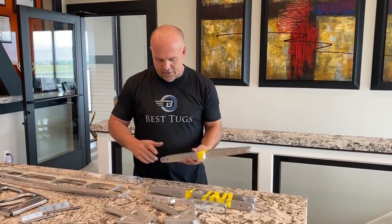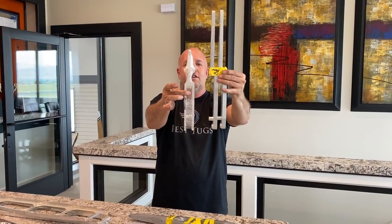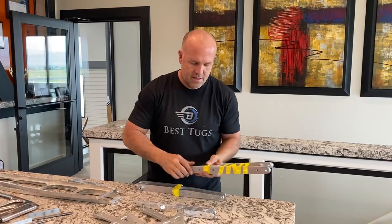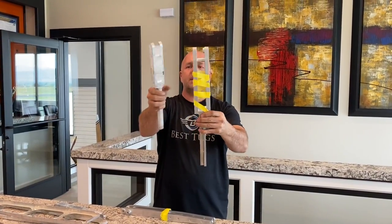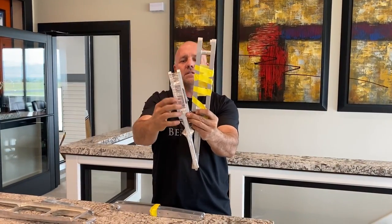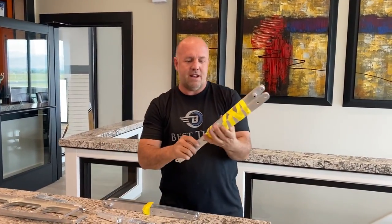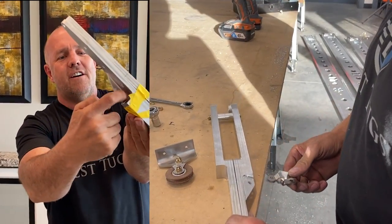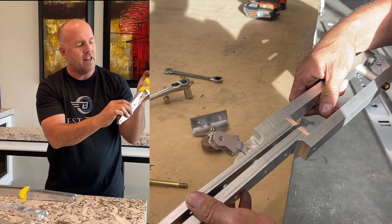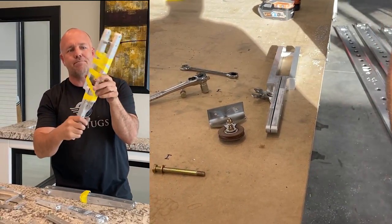So this gives you a comparison. I went ahead and did a similar design. This is spun around backwards, but this gives you an idea of Scrappy's rear spar attachment bracket and the front spar attachment bracket. Very similar in design, but you can see how much different and far apart these connection points are because my spar is so large. But one of the things I did while I was at it was a little more work. You can see if I go real close right here, I have gone in and machined this out. It's called surfacing when it's a funny angle like that. But I took one of the pulleys and I pulled it up into the wing and utilized the bracket to put in a pulley mount.